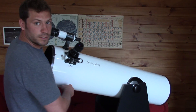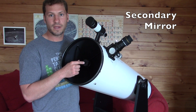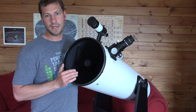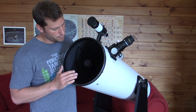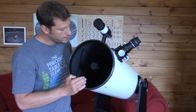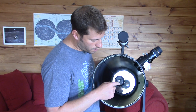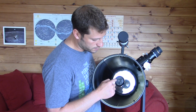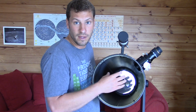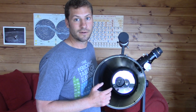The next thing we'll talk about is the secondary mirror. This is the mirror at the top that's at a 45 degree angle. If you stick your hand in the telescope, just don't touch the mirror because you'll make it a little bit dirty. It probably won't affect it too much, but you want to keep it as clean as possible and avoid having to clean the mirrors. This one also needs to be adjusted and aligned properly. On mine I have these three little adjuster screws, and I just take a Phillips head screwdriver and put them in or out while I'm adjusting the telescope to get it to where I want it.